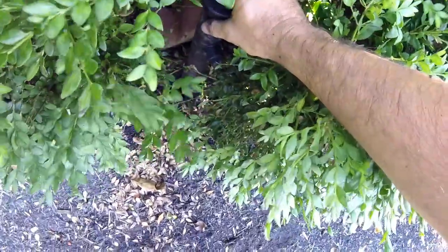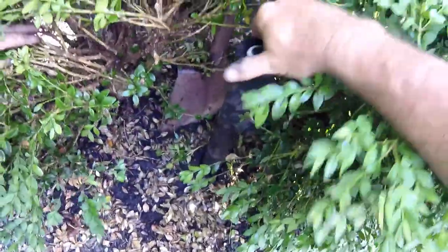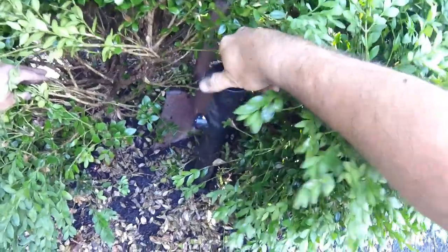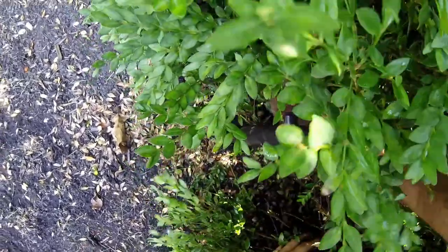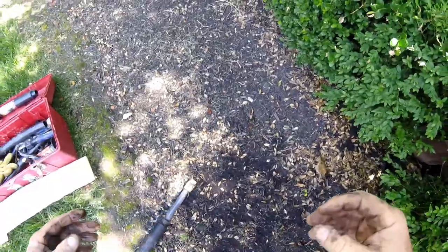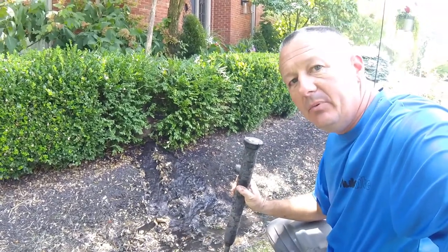So we're just gonna try to get this guy back down in the hole — carefully put her in the hole, kind of wiggle around to try to feel the threads. Sometimes it can be difficult. Sometimes if I'm having difficulty getting it in the threads, I go turn the system on — it gets a little wet doing this — and I try to thread it in there with it running. See the water flooding out of that hole? That helps loosen or bring out any debris that might be keeping you from making good thread contact.